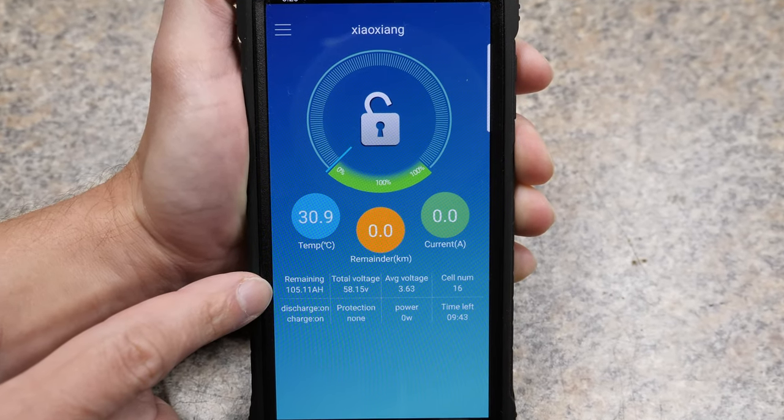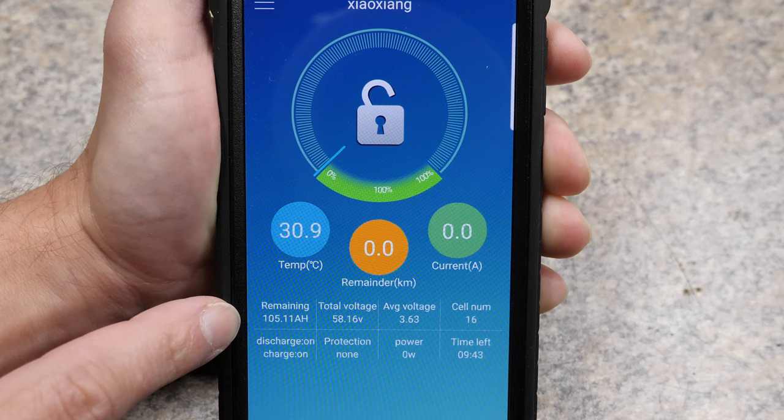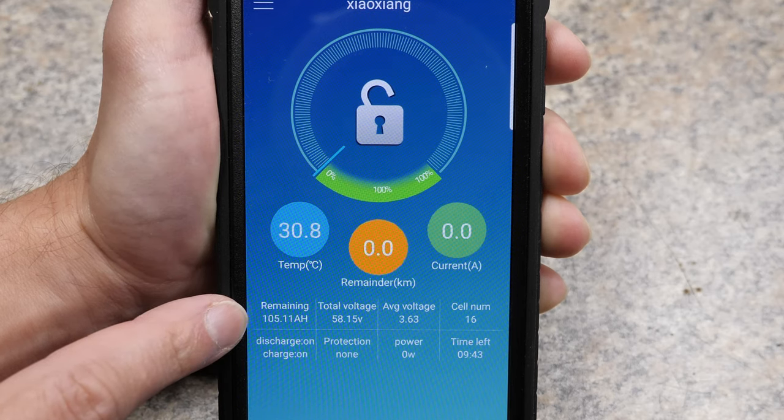That's a little bit of a lie because it's actually improved a little bit. There are two things I want to mention before we get into the capacity test. The first thing, which I already knew in the last video but forgot to mention: in the Bluetooth app it'll show a remaining amp hour reading. Whenever you do a full discharge and then recharge cycle it will recalibrate to show you how many amp hours you discharged during that last cycle. With the settings I use on my inverter I typically use around 92.7 amp hours from the battery every day.